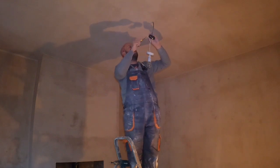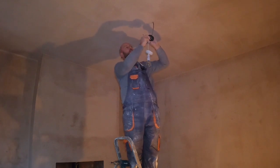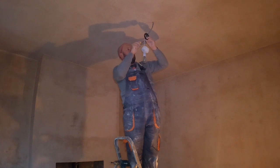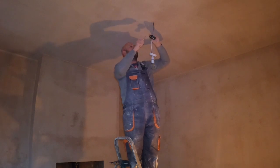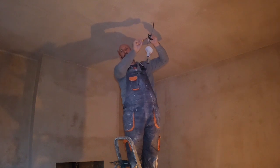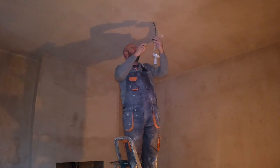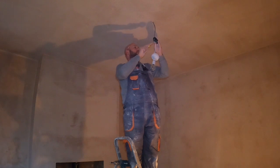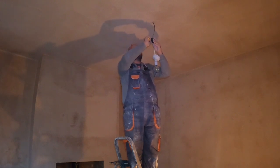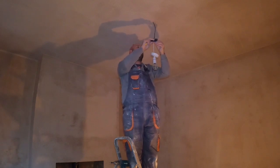So if you put nice fancy chandeliers up, I would recommend that you get them to take it all back to a central location, a central junction box, a big adaptable box, with some din rail in there and all the connections in there. It's fairly easy to get to, so any maintenance down the line, you can get to them all. Each wire goes back there independently, but the main plus side is you've only got one cable at each fitting, which makes it miles easier when you're putting fancy chandeliers up. You don't have awful bits of block connector here or knocking holes up to try and hide the wires and all that type of thing.